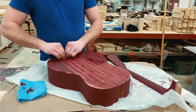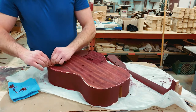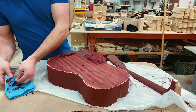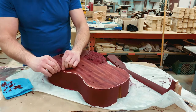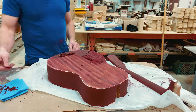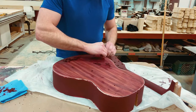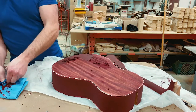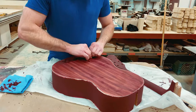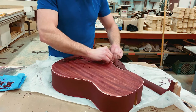And I'm pulling it along at an angle. I'm not scraping it as though I'm trying to remove wood per se, at least not to start with. I'm just pulling it along with it kind of being dragged at an angle, not cutting, but with the blade dragging behind as I pull. And you will have seen that I started off and I kind of took a layer off because I had to. I didn't want to push too hard on this. So over in the back right corner there, you can see where I took a layer off, and now I'm coming in and finishing that up. And what I'm left with here is a filled wood that is mostly ready for finish almost. You can see there are a few little patches left in the areas that I've completed, so I got to go back and finish those up.